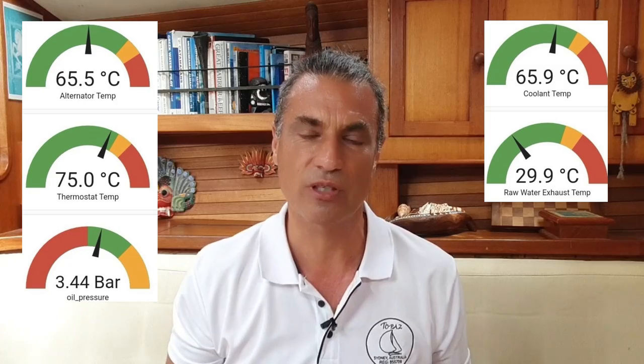A really useful aspect of smart boating is engine monitoring. I've set up an oil pressure sensor and four temperature sensors around the boat to monitor the coolant temperature, temperature near the thermostat, the raw water elbow temperature, and the alternator temperature. This allows me to receive early warnings well before the engine reaches a critical state. For example, the temperature at the raw water elbow for my boat is normally between 38 and 40 degrees Celsius. I've set an alert if it rises to 42 degrees Celsius, which would indicate an abnormal situation such as a worn impeller or no water flow at all. The alternator temperature sensor is particularly useful now that we are starting to use lithium batteries and their ability to work our alternator harder. Furthermore, you have the ability to review historical data on engine temperature and oil pressure trends, providing valuable insights into the performance and health of your boat's engine.